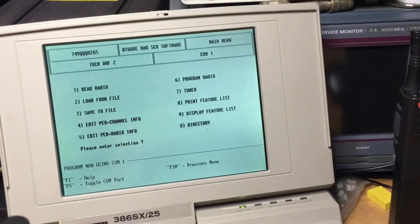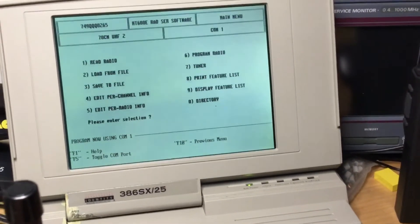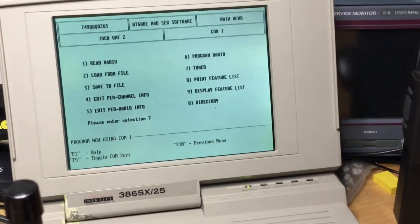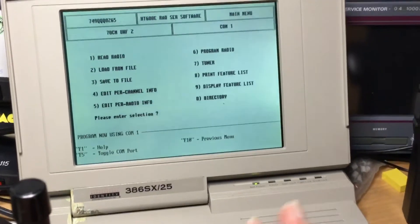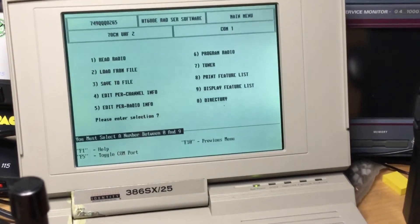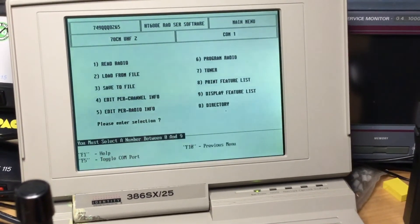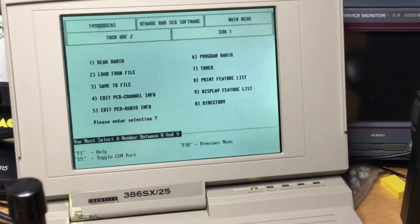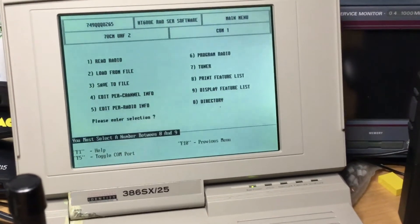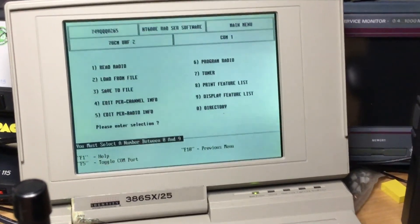If you're using modern PCs to program these radios you're probably going to have issues, especially with USB-to-serial and DOS emulators. You might need to get yourself a really old laptop or desktop machine that runs DOS, or Windows 98, which can emulate DOS. A lot of it comes down to the bus speed of the machine — that's the same for many old Motorolas. Thank you for watching — I'll be back with details on out-of-band programming and the tuner menu in the next videos. Bye-bye.